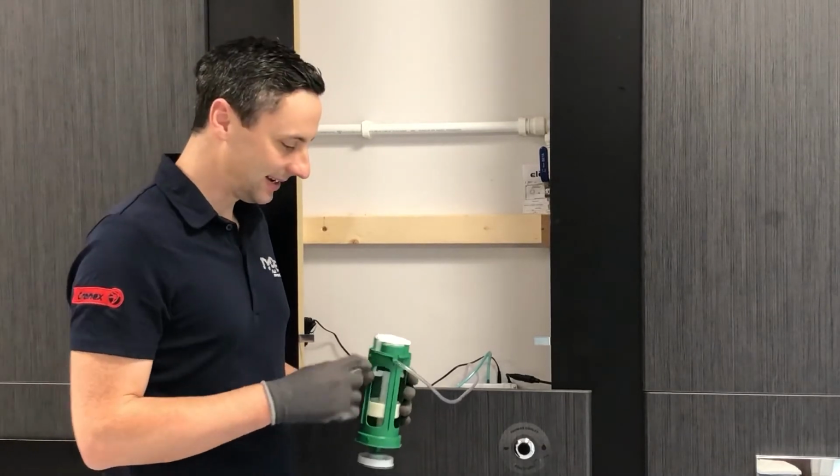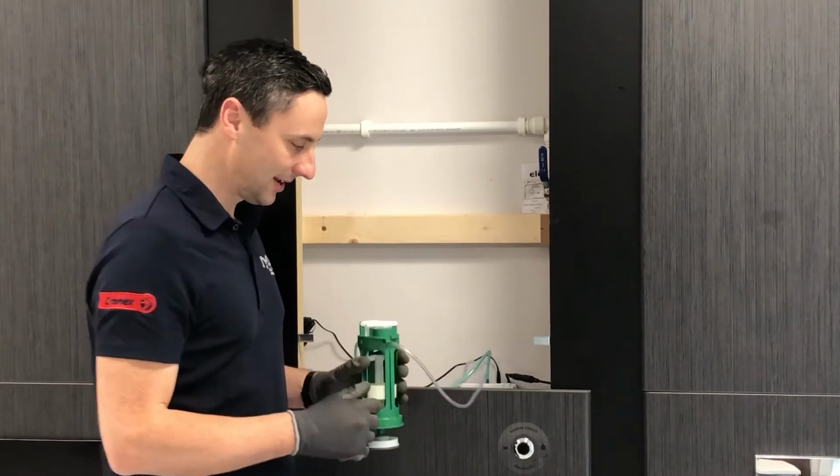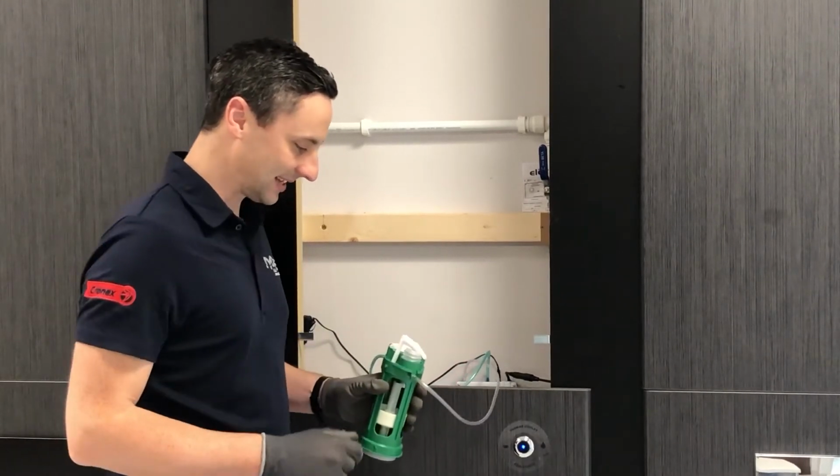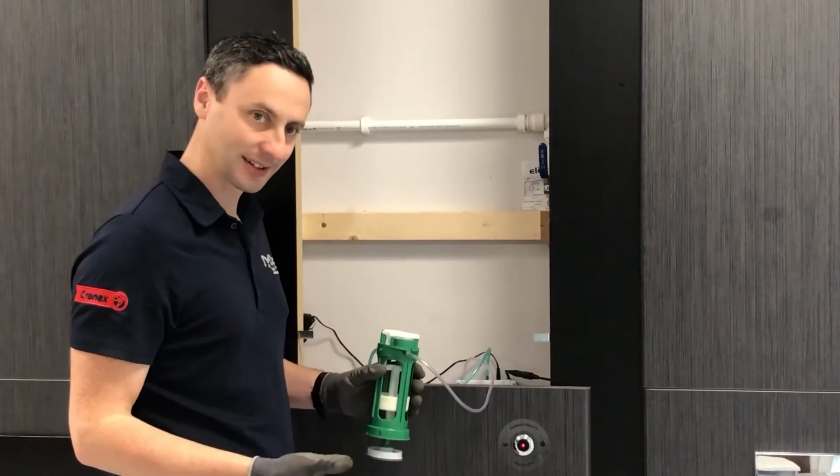If your Electroflo unit, when activating a full or reduced flush, is only letting a small amount of water by, it's also worth checking the flush bellows on the flush valve. So when you wave your hand in front of the sensor, it should fully inflate to activate a full flush and allow the flush cycle to complete.